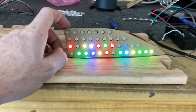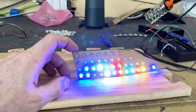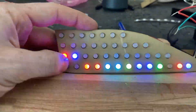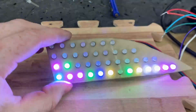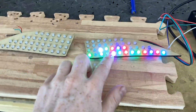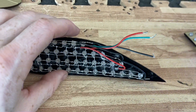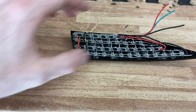Something I noticed is that these take up a lot of power — much more than the strips do. They suck up so much power that I have to route power and ground differently. Otherwise, the show mode glitches: it's supposed to run all the way across, but the bottom half freaks out. That's happening because of insufficient power injection and not enough amps — this power supply is only putting out two amps, which isn't enough. When I built this other one, I injected power and jumped grounds from top to bottom on both sides to get even power throughout.